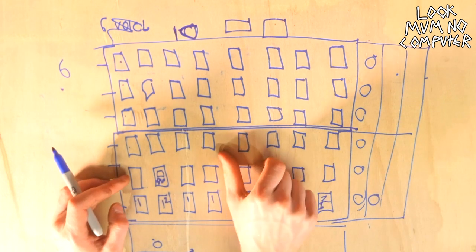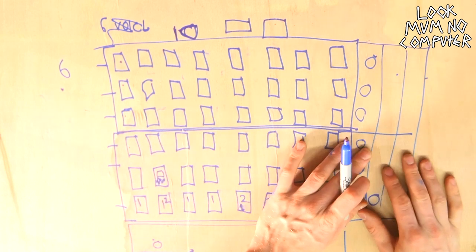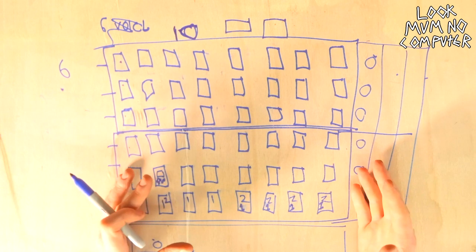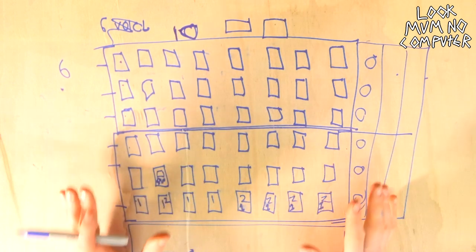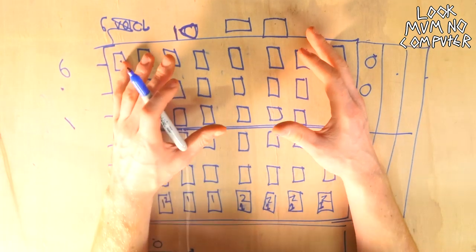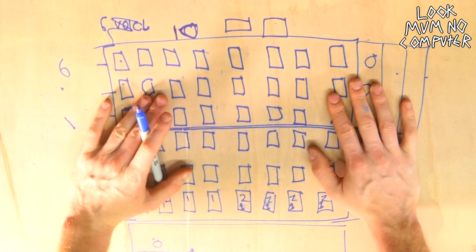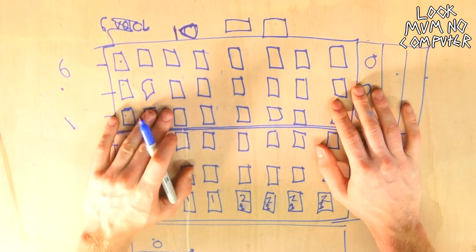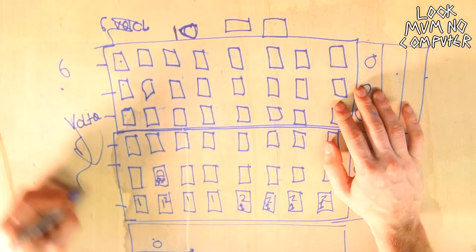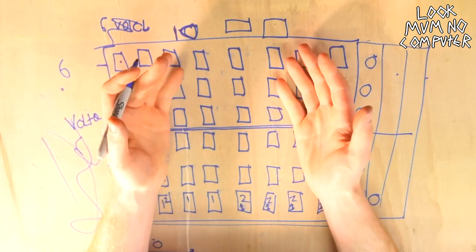So then you can modulate the volume of them before they even go into a filter, or they can bounce between the two filters. It's just, I don't know. I'm just making it pointlessly complicated for the sheer heck of it. And this is the problem. The best way I could think of doing this is just using a heck of a lot of things called voltage controlled amplifiers, VCAs. They're a very common part of a synthesizer.